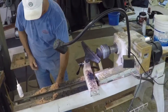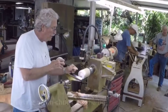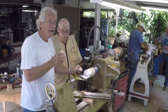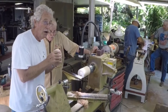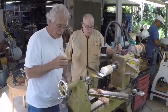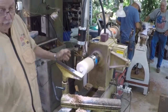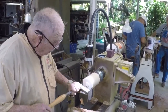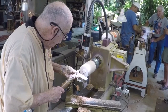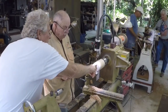What is this piece going to be? Between that piece and that piece — you've got a black rim. He's going to come in here with a parting tool, cut it down to this line, and try to make it fit. It won't go on because it's a little bit larger. You can always make it smaller, but you can't make it larger — if you make it too small and it just slips in, you can't make it larger, unless you cut it off and start again. This is going to require several things. Basically this is the most important thing you're going to do on this box. You're going to bring it in a skosh at a time — we're way off. It's not perfectly straight, it's a little bit of a cone.